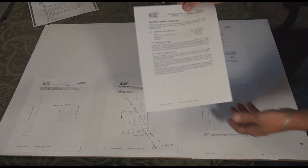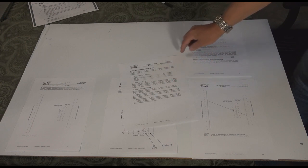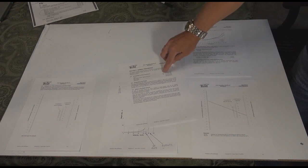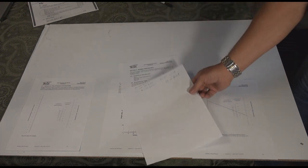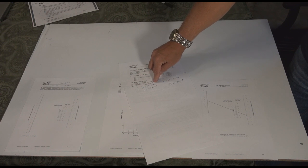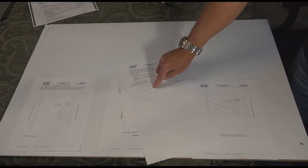These are the speeds for safe operation for the autogyro groups, and they're very, very similar for all three of their main products. Best climb for safe operation is going to be 100 to 110 kilometers. Now I've calculated these out so that we know what they are. They're on this sheet, and to give you a better idea, they're written right here. 100 kilometers is about 54 knots. 110 is about 59 knots. 90, which it shows here, is 49 knots.